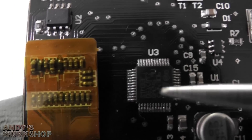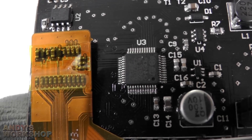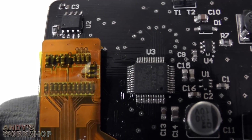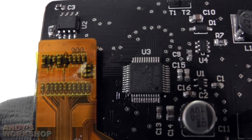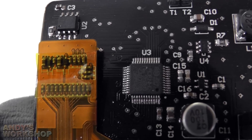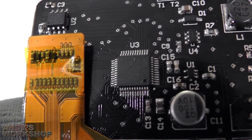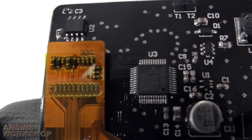Here is the co-processor itself. It's an STM32F051, an ARM Cortex M0 core. In standard mode it runs at 48 MHz. It's got 64K of flash and 8K of RAM, which is plenty for providing all the graphics routines and even doing JPEG decoding. I actually overclocked this to 64 MHz, as you'll see in the article, so I can get the absolute maximum out of the LCD.